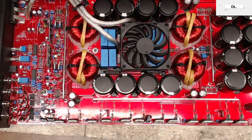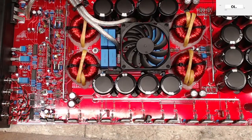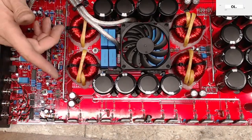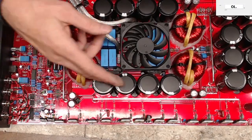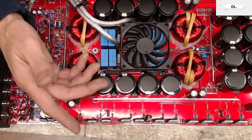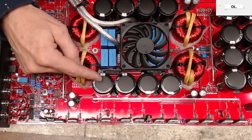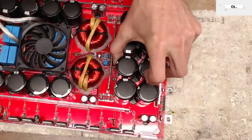Now, don't get me wrong. You could still have leaky transistors. You could have leaking gates. You could have all sorts of leaking issues. But again, 99% of the time, a resistance value will point you in the direction of either having a problem or not. And just by reading what these are showing me, this is all the new bank here, the resistance values are telling me that it would be okay to slide this back into the heatsink, bolt the thing back up, which I love these boards for.